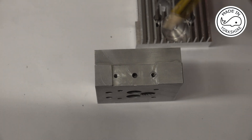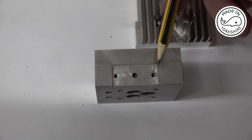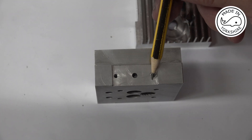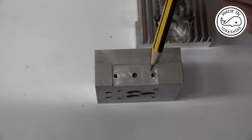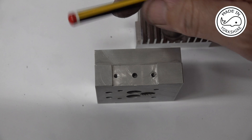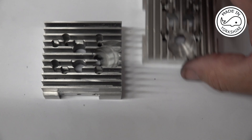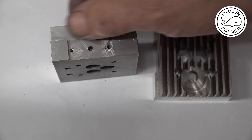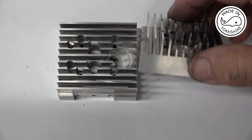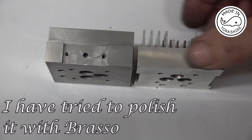I think I got there in the end — that's the freshly tapped hole. I did nearly goof up again — I nearly started milling out a hole that didn't have a tap in it, but I realised after going to a depth of about ten-thousandths. It's come out really well — happy with that. The only disappointing thing is the alum does have a bit of a dulling effect on the aluminium, so it doesn't exactly match the other piece, but I guess over time the other piece will tarnish anyway.